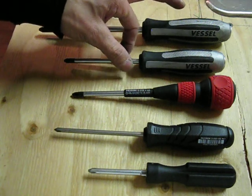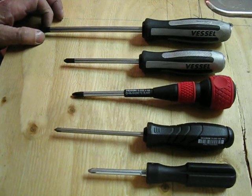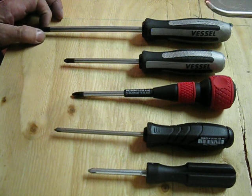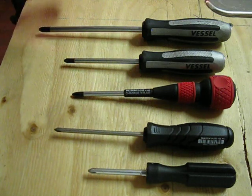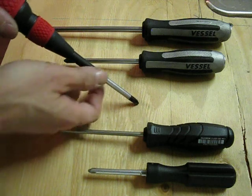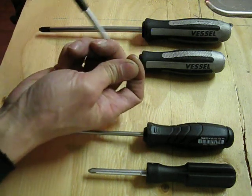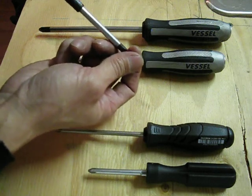How the Japanese standard works differently compared to Phillips: Phillips screw heads, when they were originally designed, were made to be more idiot-proof — designed so that people who are not skilled would be able to use them and not strip things. On the Phillips, usually when you get too tight, what happens is you're spinning it and it gets too tight, the torque gets too high, and the Phillips screwdriver will actually cam out of the head — it actually lifts off. So when you reach maximum torque, it just slips out so you can't over-torque that screw head.